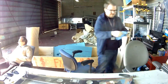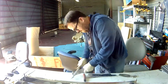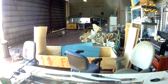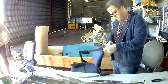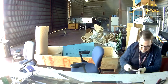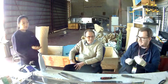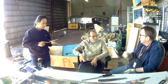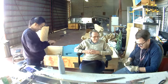This is the bulkhead that goes more or less right behind the seat. What we're doing is basically attaching the left and right braces to this bulkhead, as well as the two attachment points for the rear spar of the wings. To help it line up, you temporarily attach the crossbar — the bar that's basically right behind your seat.